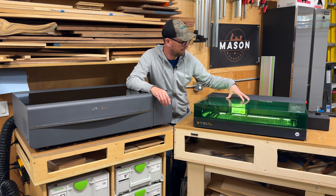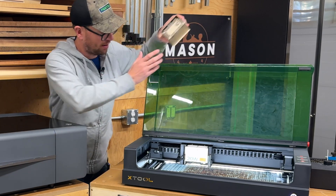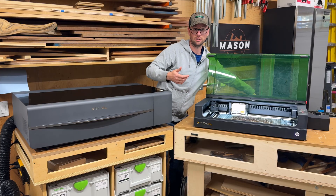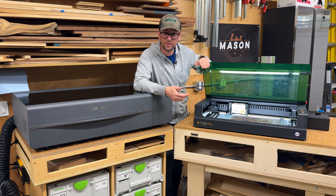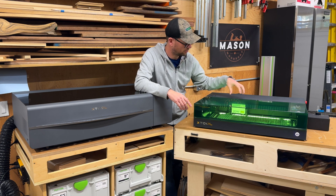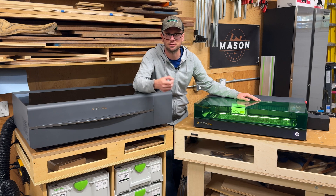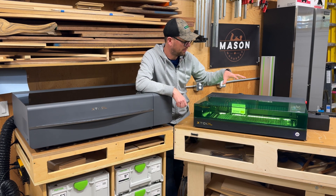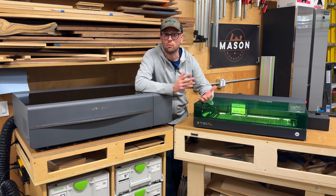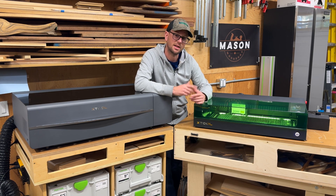What's super cool about the S1 is that there are swappable laser modules. Right here I have the 20-watt version installed. I also have the 2-watt IR laser, which brings additional capabilities when it comes to engraving metal. When it comes to engraving jewelry, the 2-watt laser really excels compared to the 20-watt diode, which really isn't capable of engraving metal without a special laser etching spray — and then it's more of an etch versus an engrave. The S1 is available in 10, 20, and 40-watt flavors.